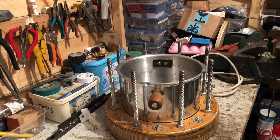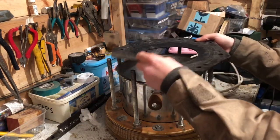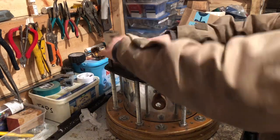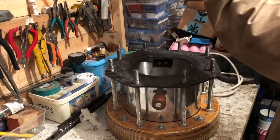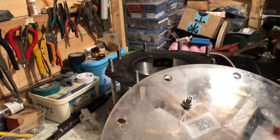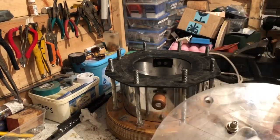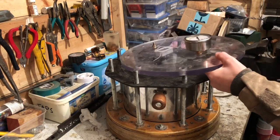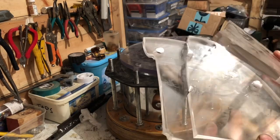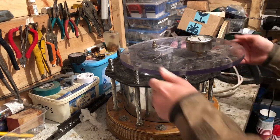I needed a seal, so there's that vulcanized rubber stuff that lines up perfectly and goes over there. There's a nice layer of grease between the pot and this. Then I chose the lid — I got rid of the aluminium lid and got some polycarbonate. Polycarbonate is absolutely rock solid — it has a flex to it but it doesn't shatter. I did try Perspex, but the results of that were not good. So I'm using polycarbonate — this is 12mm — and that fits nicely over the top.